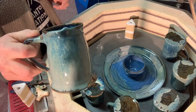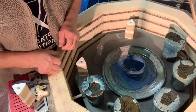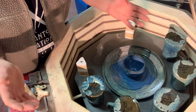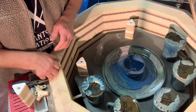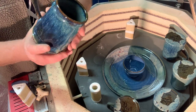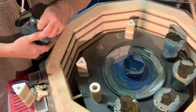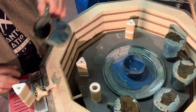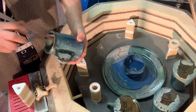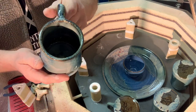That's the variegated blue, which is really bad for running. The profile on this is: I fired it to 2205 with a 20-minute soak, then speed-cooled it down to 1750 — meaning let it cool naturally — didn't slow the cool down at all, then soaked for an hour at 1750. That one did good too — they didn't run to the rim except for that one, but they flattened out on the bottom.